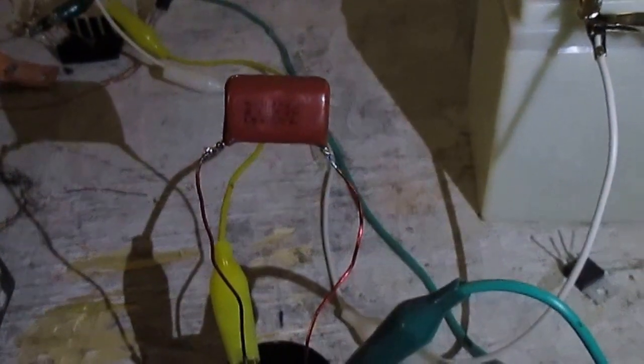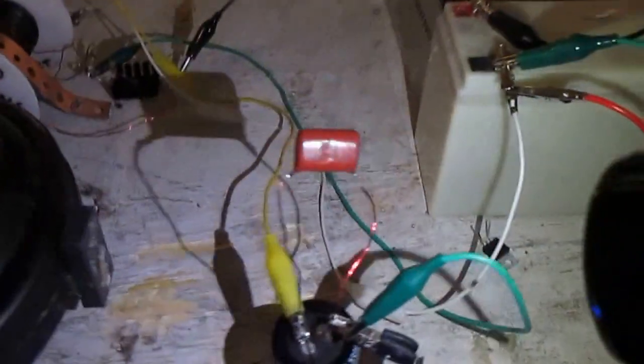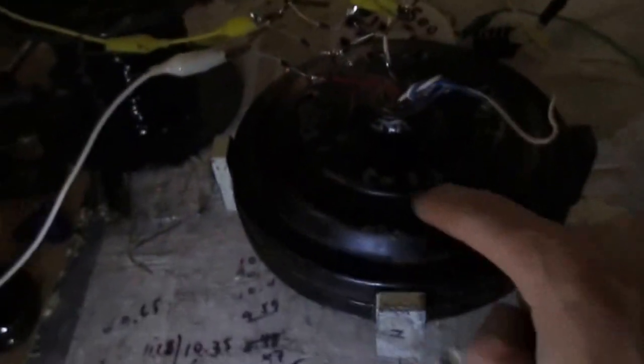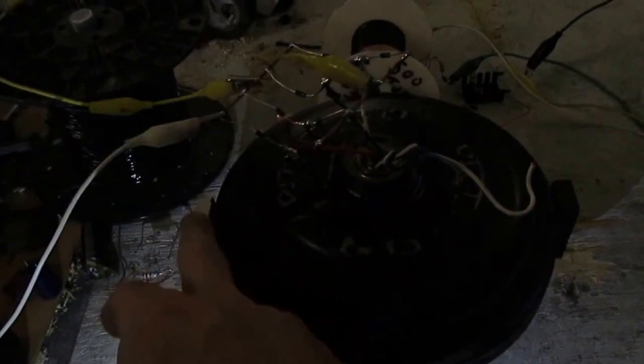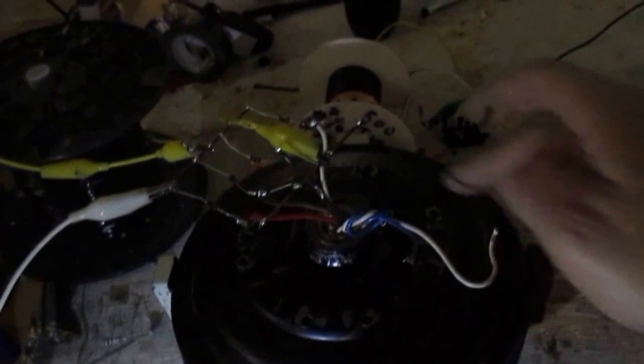This capacitor bank is being powered by the power supply and also has a 1-kilovolt 9-nanofarad AC ceramic capacitor mounted across it to catch the spikes so I don't blow out the capacitor. This main capacitor is only rated for 80 volts, and that ceramic one is rated for 1 kilovolt, so it will catch whatever spikes come back to the power supply. I've already blown a few power supplies, so this protects against that.